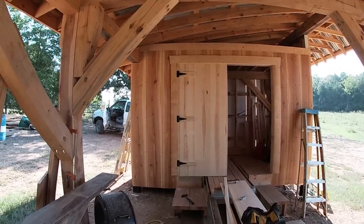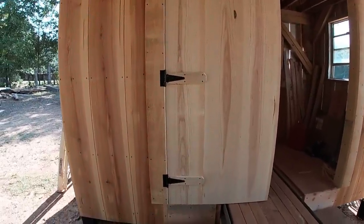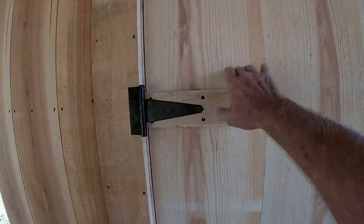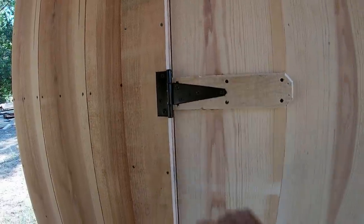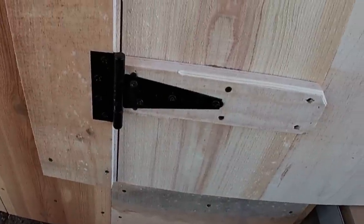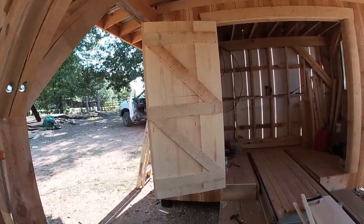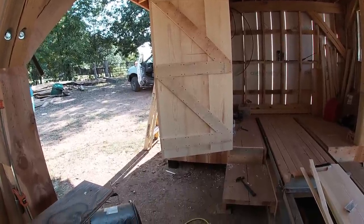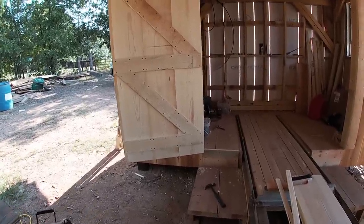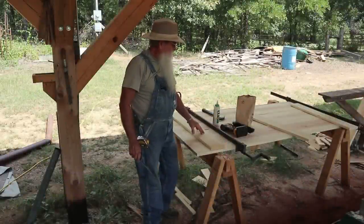I've got one of the doors built and hung. I've still got the other one to do, which I'll try to get done today. I've got three hinges on it — it's a little heavy for a door but I was able to get it up without much problem. I chiseled in so the hinge would be mortised into the trim. On the inside I put three cross pieces, glued and screwed them on well, and then I put two Z-bars. The Z-bar pushes up from the hinge side — a lot of people get this backwards, but pushing up from the bottom side carries the weight and keeps the door from sagging.